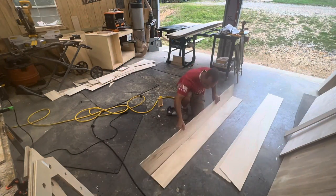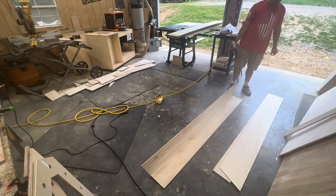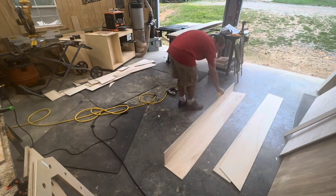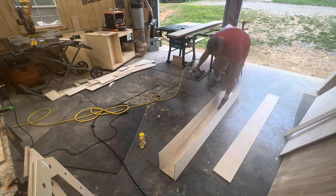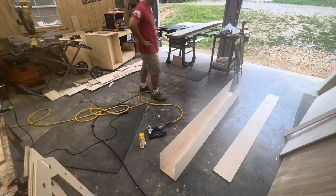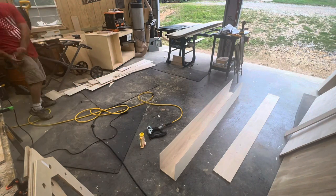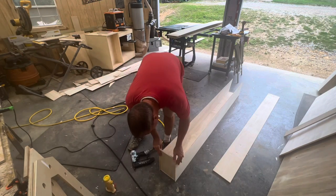If you buy the plans, you'll see that I'm using half-inch sanded ply and quarter-inch sanded ply. I did that because it's really hard to shoot brad nails into quarter-inch. So the top and the bottom are half-inch plywood and the sides are quarter-inch. I did that to save money, because if you buy half-inch for all of the box, it's going to cost you more.